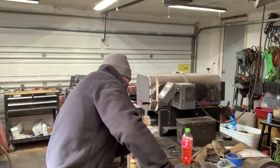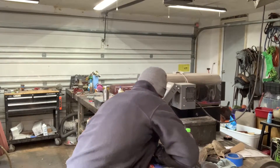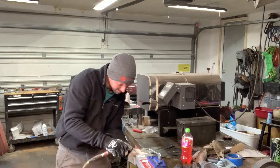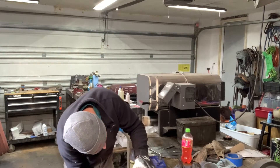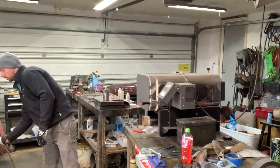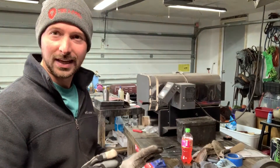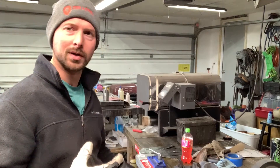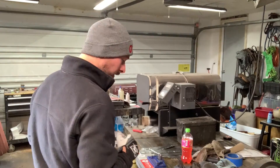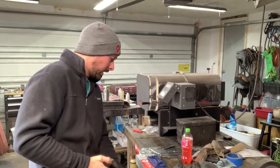It's been soaking for about 20 minutes. The plates cooled off really fast — I just threw a fan on them. We're going to get this thing out of here and get it in the plates as fast as possible, then blast it with compressed air to cool it off as quick as possible. You can see you've got to get it in there fast and put a lot of pressure on it, then right to the compressed air. I like to let it sit in the plates for about a minute — by that time the aluminum has absorbed the heat really well and you can almost touch it with your bare hands.